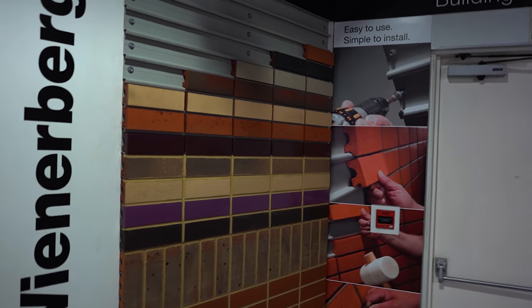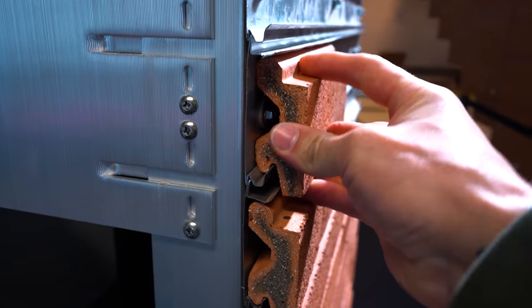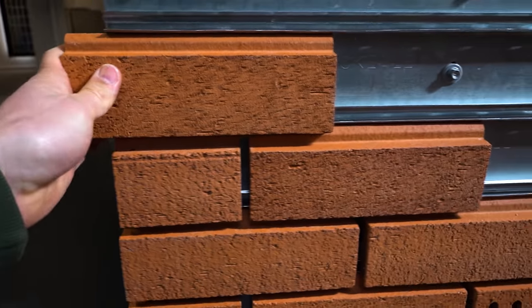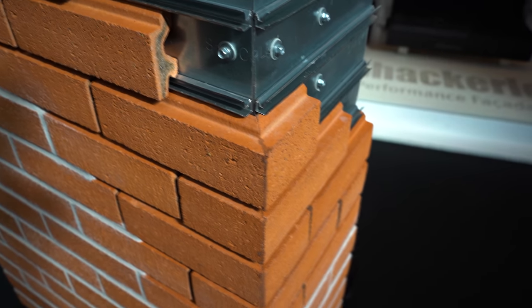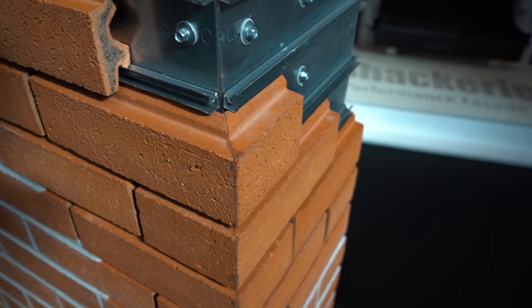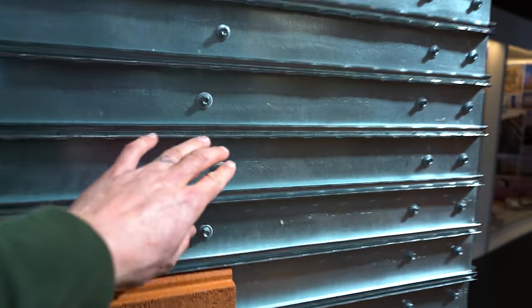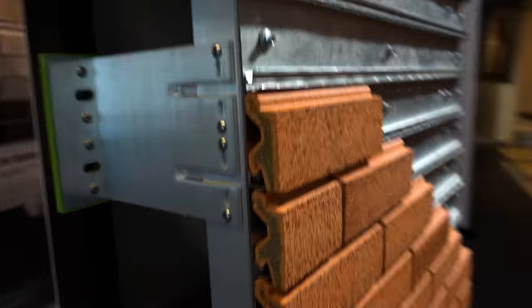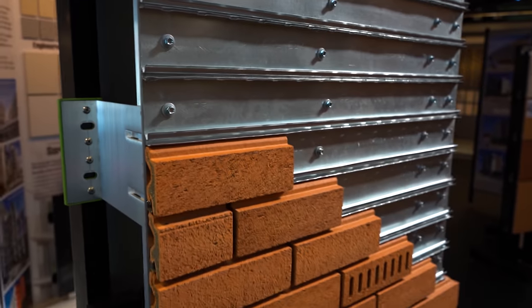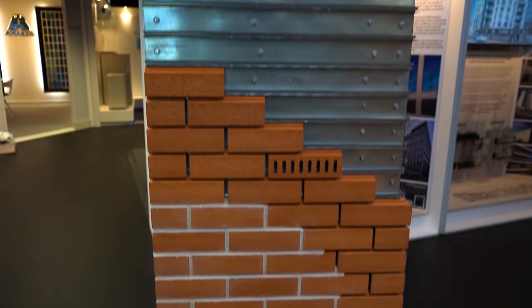Is that the cheaty way to lay bricks? Let's have a look at this one over here — that's the actual system there. You can get some nice crisp perps in there — look at that, some good perps going down there. You can tell just on the edges that joint is slightly off-coloured. I don't know if I'd like that. But like I said, I bet that's quick, I bet that's easy — anyone could do it. You've just got to screw these railings onto the building. I guess this is probably what you'd use on a timber-built house. You wouldn't want to put that with a cavity and blockwork.